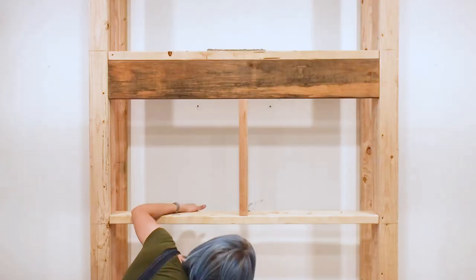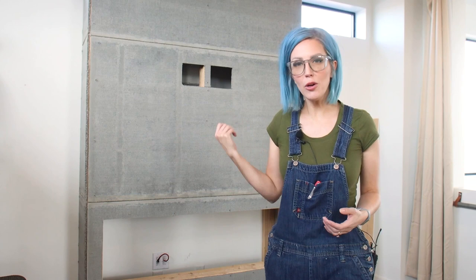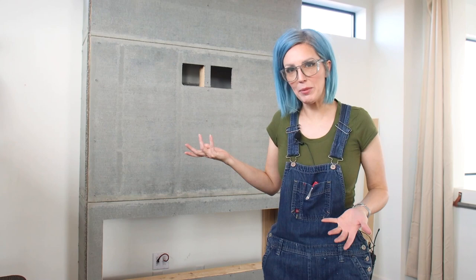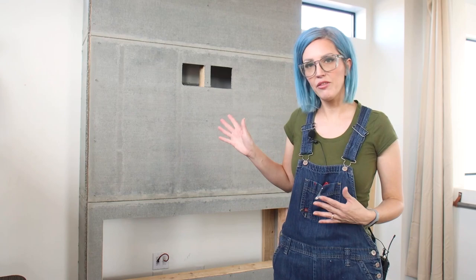Once our vertical blocks were in place, we could begin to skin the entire frame. We are using cement board panels to skin the outside of the fireplace. We decided to use cement board for a couple of reasons: it's the most versatile option, and if we decided to put stone on the fireplace, you need a masonry base to attach it — so that means cement board. Additionally, it was actually the cheapest option. Wood products like MDF, plywood, or OSB are so expensive right now that cement board was cheaper, better sized for the project, and produced less waste. If you have no plans on using masonry on your fireplace, wood products like plywood or MDF are perfectly fine to skin the outside of the framing.